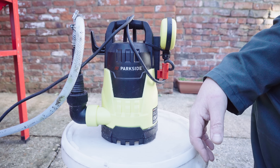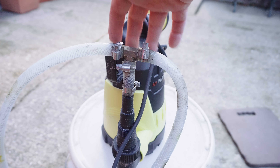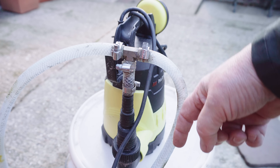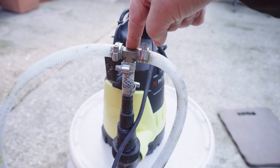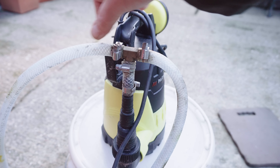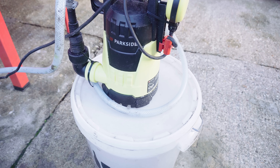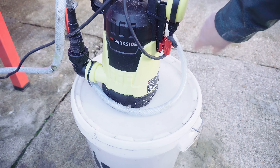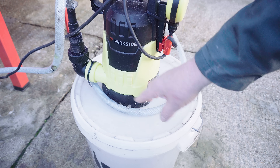Good to go, and if it burns out you can always buy another one because they're not expensive. Where the water comes out of the pump I've actually got a T-piece. The idea is the pump not only sends water down one pipe for your blasting, it uses the other pipe to keep the slurry agitated in the tank. So it's important that you consider making some sort of device like this. All of the hose for the water side is 12.5 millimeter internal diameter — it's braided half-inch hose. The end of the hose used for agitation I've cable tied around the base so it'll stay at the bottom and keep water going around. I've also put a couple of holes in the pipe to add to the agitation, and it seems to work a treat.